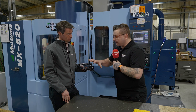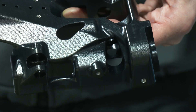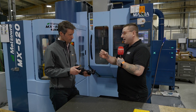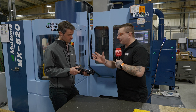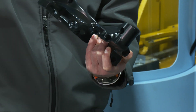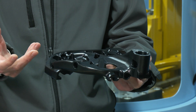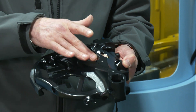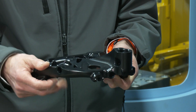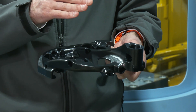Looking at this part — this has been finished and you cannot tell that different tools have been used; essentially it looks like it's been printed. So how does HyperMill get such a nice finish over multiple different tools and toolpaths? When you're in different regions or different positions doing three-plus-two, each time you change tool or change position you're introducing a potential small error. What we look at doing is when we pick out a 3D surface, HyperMill will automatically extend the surface so the tool goes past — so when you're in a different orientation or different surface, you get this nice blend between the two. The tool doesn't just stop, it goes past.